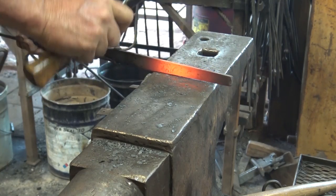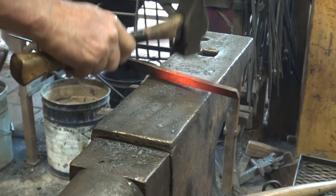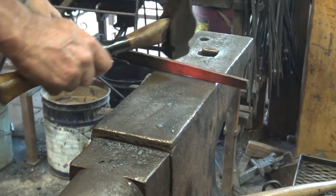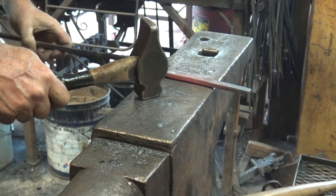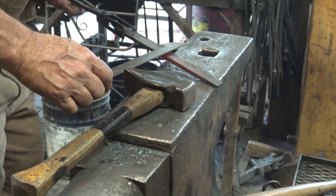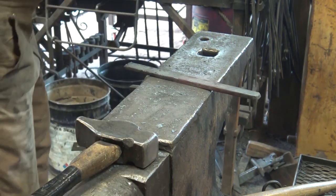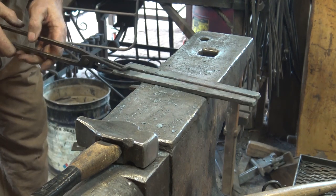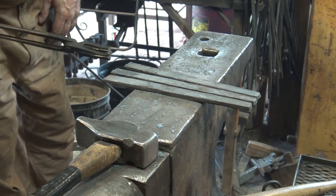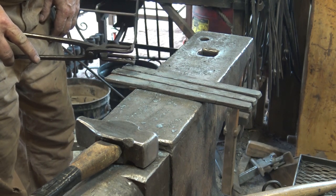This is a very simple leg, so doing a good job on the taper is really fairly critical, because the taper is really the only element these legs get that makes them stand out. If it's lumpy and bumpy and uneven, you won't be very happy with it. My goal is ¾ of an inch at the end, and about halfway up so it's a fairly even taper. The other critical thing is that you do your best to make all three legs match — I work all three legs together but just show one on the video, and these are all pretty darn close.